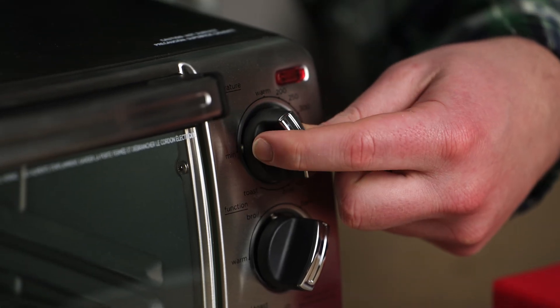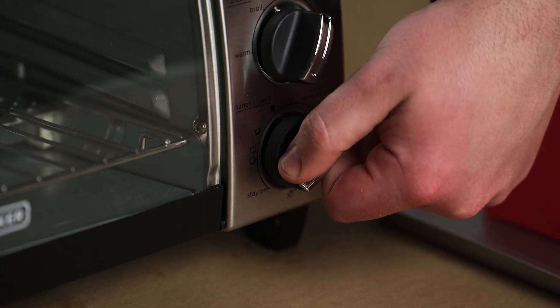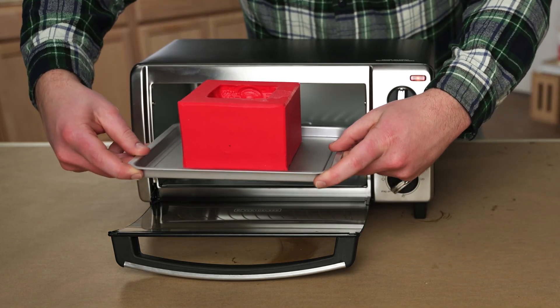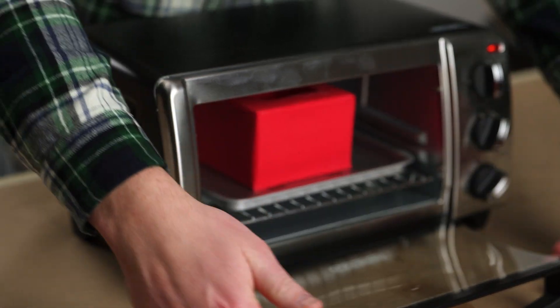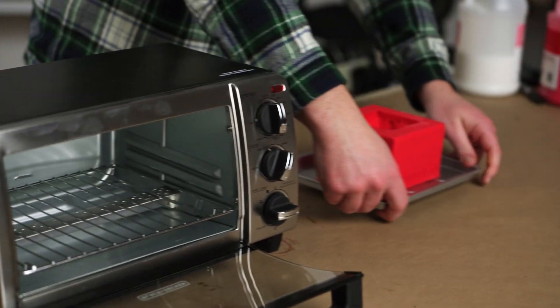To post cure our silicone, we'll let our mold complete its cure time, demold our master, and then place it under approximately 150 degrees Fahrenheit for anywhere from three to eight hours depending on the material. The most common tools used for this are a dedicated full-size or toaster oven. Do not use your kitchen oven or any oven that will be used to cook food — it is important to use a dedicated oven for this operation. Once the time has elapsed, we remove the mold from the oven and allow it to come back to room temperature before we begin casting.